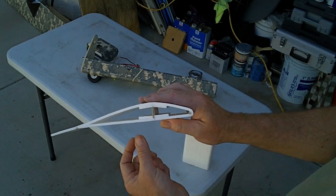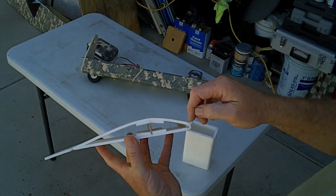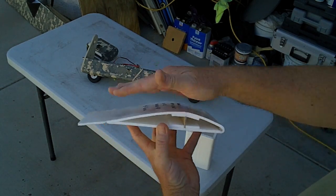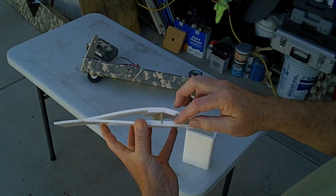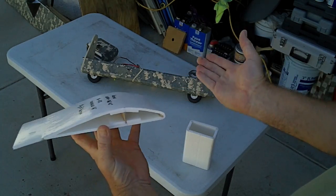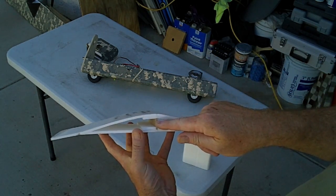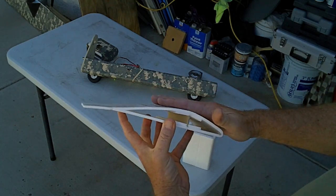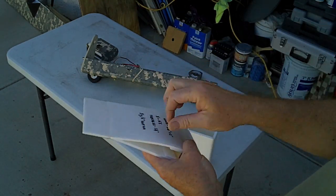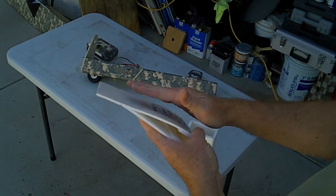Practice, make samples like this. You can substitute your wing spar material with pink foam, or you can use the white foam board as a spar in here, just to get these dimensions and play with folding and hot gluing and putting all this substructure inside. While this is open, you lay out all these pieces, locate the top one while it's laid out flat, hot glue it down, and then fold it over. All you're doing is applying a little bit of hot glue on the top of the spar, making contact. Let that get cold, and then this is still open here in the back, right? Then you run a bead across the back, take a long flat pressing board or something that you can press this down with continuously, and then you close that back end up.